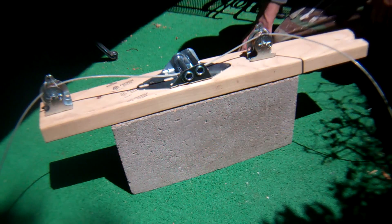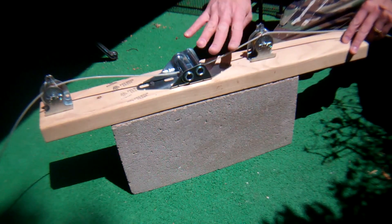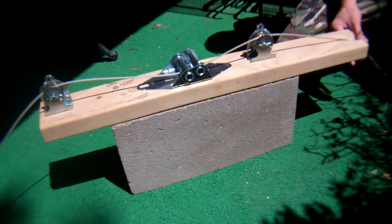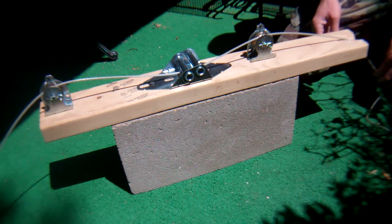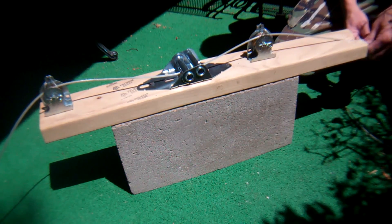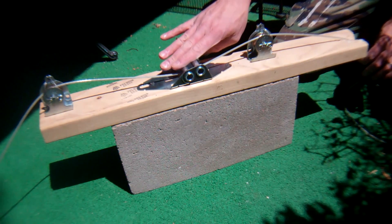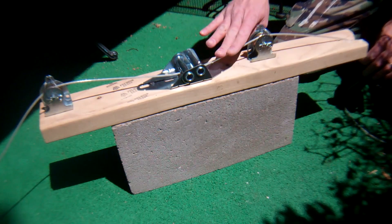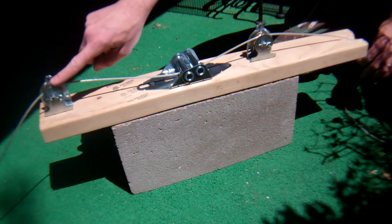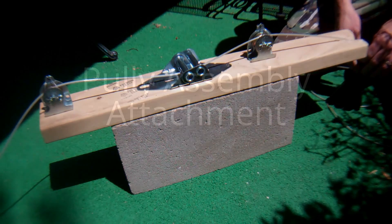The pulley mechanism is now fully assembled. This side goes down to the ground, this keeps tension with the other pulley, and this side attaches to the mast. The cable will actually be pulled from the other direction. This will keep the cable from getting gouged and scraped. These rollers — which are actually a garage door hinge, believe it or not — will keep a little bit of tension on the pulleys so that the cable doesn't slip out of the groove. The wires keep it captured, and the idea is to pull it up from the ground using this mechanism. Pretty simple, pretty quick and dirty.